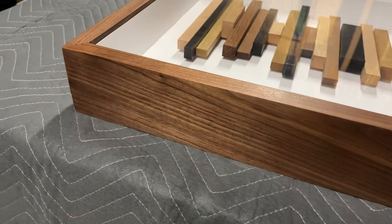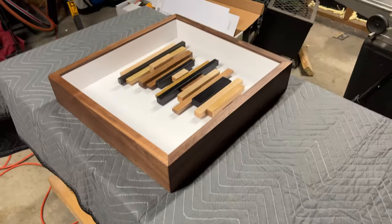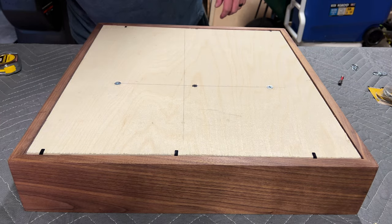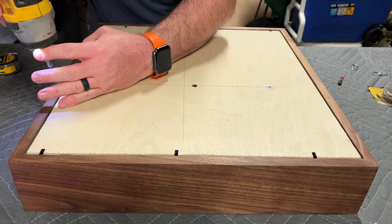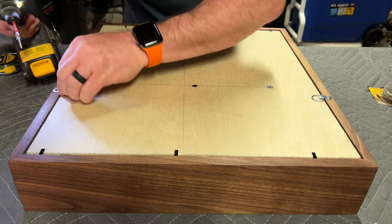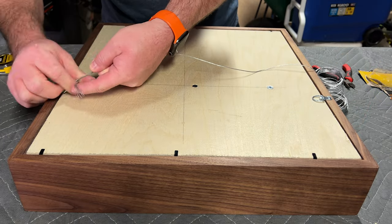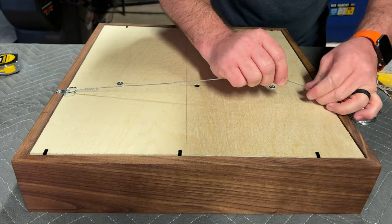Here's a quick view of the finish — all those miter joints look perfect. Any tear-out was sanded down and it turned out beautiful. I don't have any splines; I figured the joint is big enough to take the risk, and if something happens I can always go back and add a spline later. Off camera I mounted the board to the frame with a brad nailer, then flipped it over, measured down and in on each side, pre-drilled a couple of holes, and mounted the D-ring flaps that I tied the picture frame wire to.